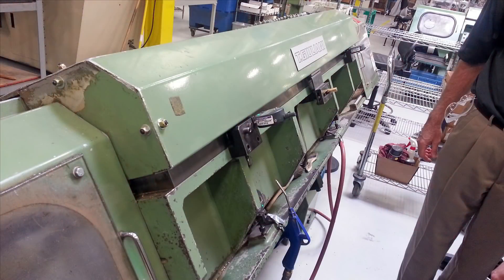You can imagine how they made it. Anyone who knows anything about machining and production — there's this giant Giuliani machine. This is one of the machines at Carmel — probably in Indiana, when I was at the Schlage factory — and it's for broaching the plugs. You load a huge bunch of plugs in a tray, slap it shut, and this machine just chon-chon-chon-chon pushes them through a series of dies to make the keyway. That's why keyways are broached all the way through the plug. If you load the blanks in backwards, you get additional complexity for free — you don't have to spin up new tooling. The Giuliani company is still around, still making lock hardware — they're from Italy — and this vintage machine is still kicking.